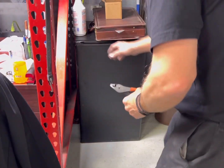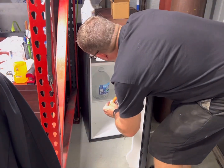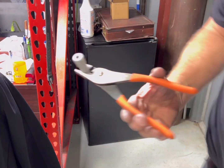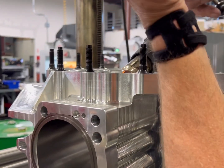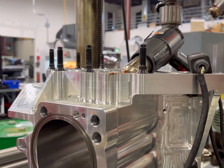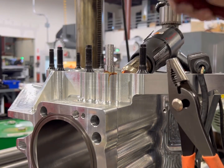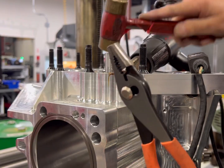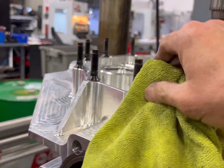You can see here how I'm going to set this up. I have to put the other dowel in from the other side — I measured these things, and one of the dowels was about a thou too big, so the kid putting it in was having a hell of a time. I take it out of my little ice box and use this high-pressure lube that helps when pressing steel into aluminum or any tight-fitting stuff. We even use this on the top of our push rods when first assembling the motors. This here is my old-school Snap-on brass hammer — a chunk fell off of it. It's been a while since I've used it, and the damn thing's falling apart.